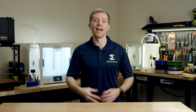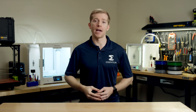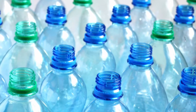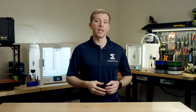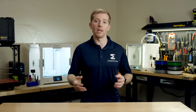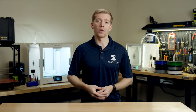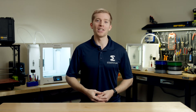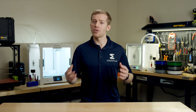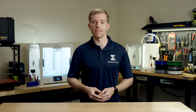So what is PCTG? Everyone is familiar with the polyester PET, which stands for polyethylene terephthalate. It's the polymer used to make plastic Coke bottles. Polyesters are popular engineering materials because they have excellent properties at a low price point. In 3D printing, PET is commonly modified to be amorphous by making the copolymer PETG. PCTG, which stands for glycol modified polycyclohexylene dimethylene terephthalate, is very similar to PETG but has some interesting properties that make it stand out as a higher performance engineering grade resin.